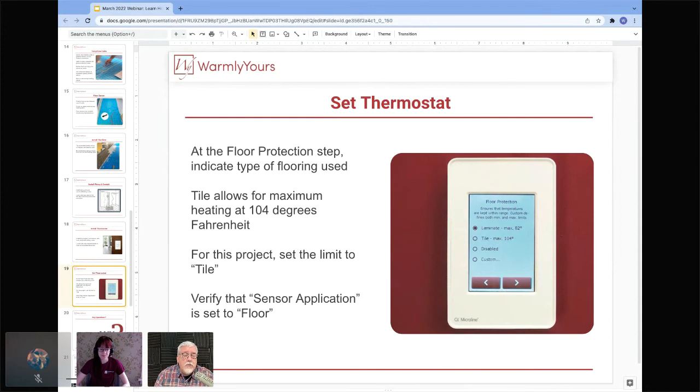And if you're interested in doing sole source of heating, make sure you contact us or go on our website and look for the heat loss calculator, because that will tell you how many BTUs your room needs. And then it will compare that with how many BTUs the floor heating can provide. That's why it's so important to talk about these things now, because we get these questions all the time. I'm not going off topic too much, but these are important things you need to think about if you want a successful installation that meets the expectations of the people who are paying for it.